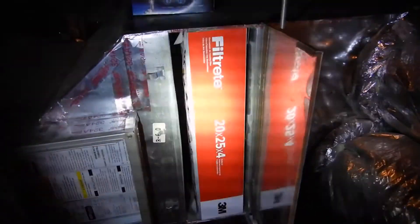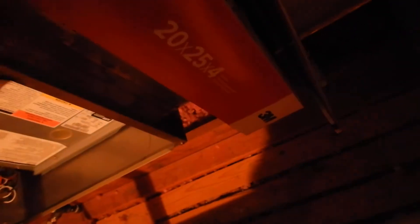The air filter is at the unit — it's in the attic, on the right-hand side of the unit, which would be the east side of the house. It's a 20 by 25 by 4. You want to change that. The gray material is really hard to tell if it's dirty or not. I don't have a date on this — you need to start tracking that.